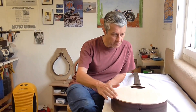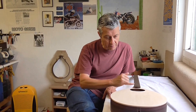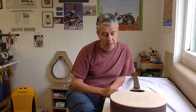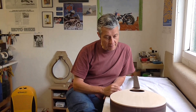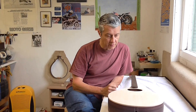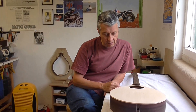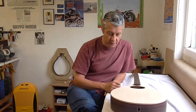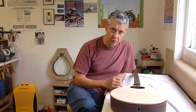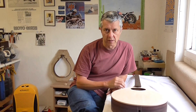At the moment the bouzouki has just been sanded; it's had its final clean up and the wood itself is almost shiny at this stage, simply due to the preparation going through a whole load of fine abrasive materials. When you do that final clean up it's essential that you have good daylight so you can see any imperfections. Finishing an instrument doesn't hide any marks — if anything it accentuates them — so it has to be perfectly prepared before you apply the finish.